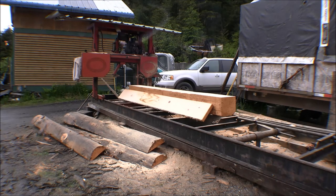That board that I just tipped up there has a little bit of rot on the face of it, but the next one would be pretty good. It's got some interesting green stain in it that would be a nice decorative thing for somebody that was into that kind of stuff, but I wouldn't use any of that for structural wood. Well, now I'll turn all those up on edge, stack them up on edge, and run through them three-quarters of an inch at a time or an inch at a time and make stickers out of them.